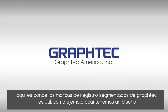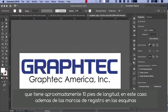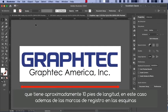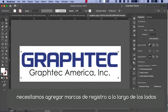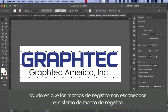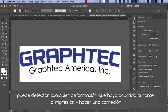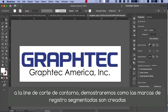This is where GRAPHTEC's segmented registration marks are useful. As an example, here we have a design that is approximately 10 feet in length. In this case, besides 4 registration marks on the corners, we need to add registration marks along the sides and perhaps at both ends of the design as well. The segmented registration marks help in that as the registration marks are scanned, the registration mark system can catch any warping that has occurred during printing and make a correction to the contouring cut line.